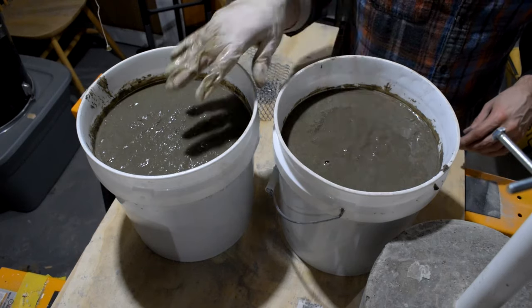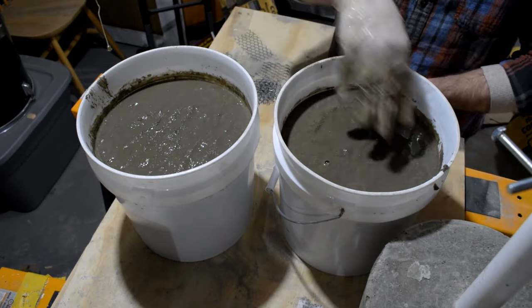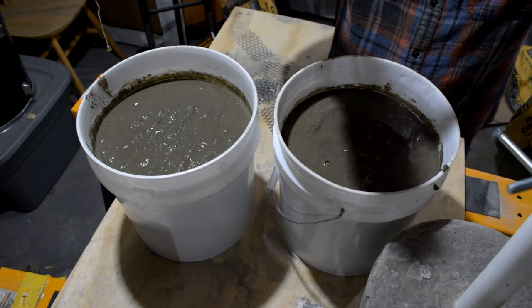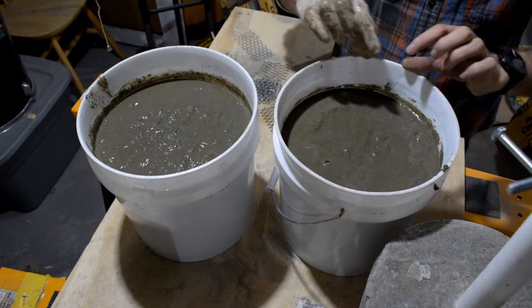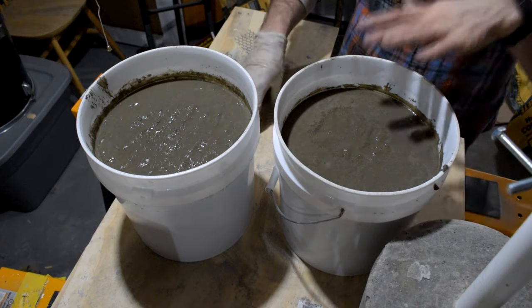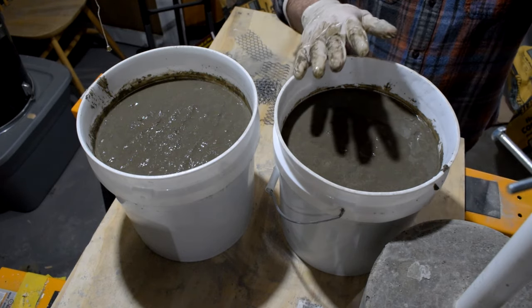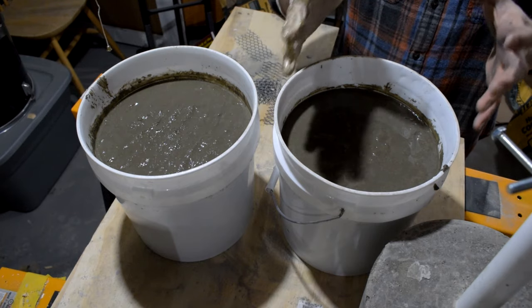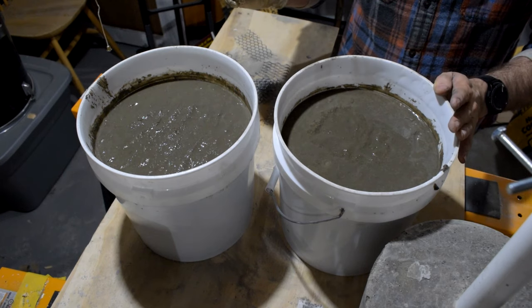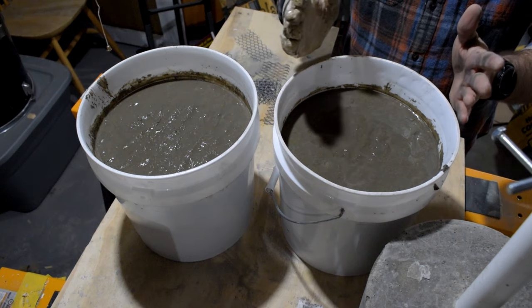Okay, so we've got the other halves poured. We've got the first layer of the steel mesh put down into the bottom. So now the trick is going to be setting the other half on top. Hopefully we've got enough space here to put the second layer of this mesh on top once that's over it. And then balancing this other half that's already cured on top of it, and we'll use tape to get it in place. Hard part's getting it completely centered and balanced vertically.